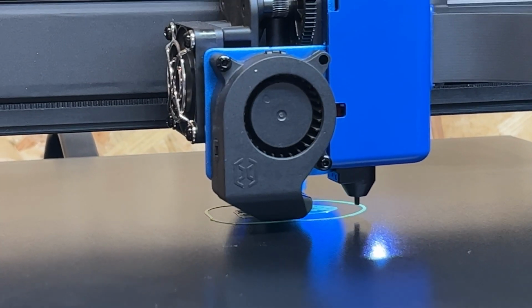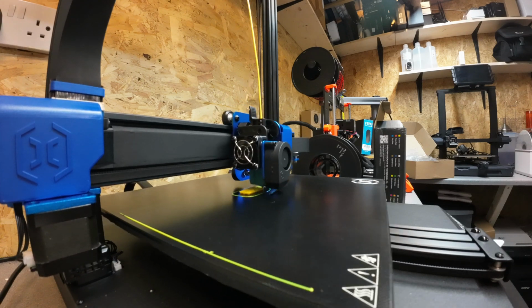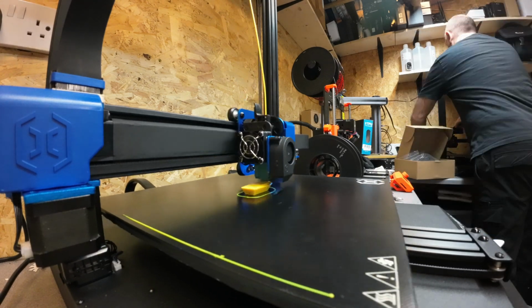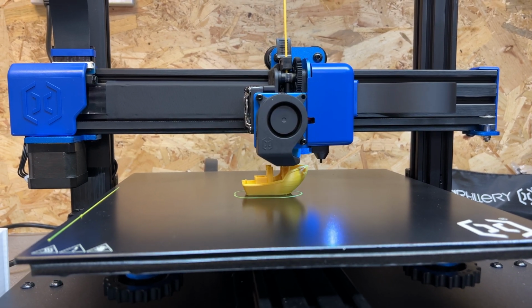And overall, other than some tuning on the Z-axis, everything comes out okay, although I am seeing a little bit of bubbling around the bottom layer on the benchies. Not exactly sure what the cause of that is at this time. I'm not seeing it on other prints. It may be a slicing issue though in Cura.